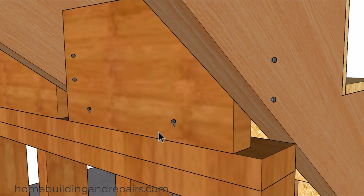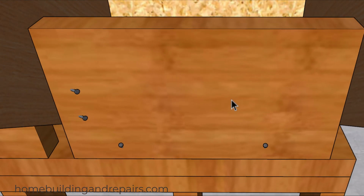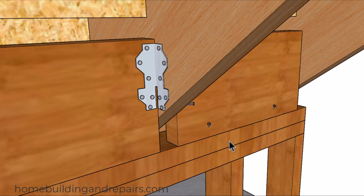So we're going to have a block over our wall so that we can nail the stringers to the blocks. We're going to toenail the blocks into the wall framing, and then you can always toenail the blocks into the stringers if you can't end-nail them. And I'm not about to suggest these are the only ways you can strengthen a stairway that is moving from side to side, but this will definitely get you started in the right direction.